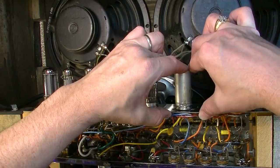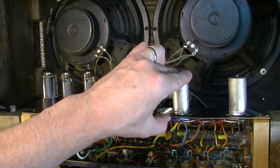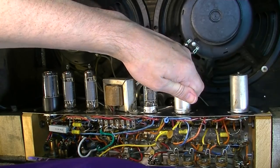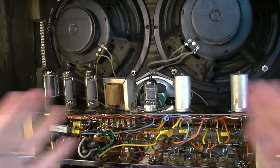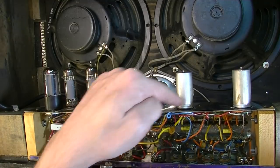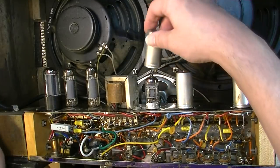And that's one thing that probably a lot of techs are not going to tell you, unless you just ask them to do this. They're in the business to sell you the tubes and to make it right as they possibly can. And I think a lot of times techs don't see it from a consumer perspective. You know, where you can save a little bit by just swapping a tube around, and you can actually make your amp sound better in the process.